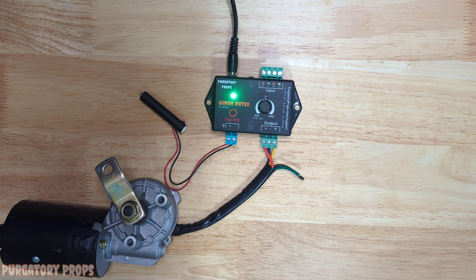Output zero has different modes. The default mode is on all the time during playback. There's start mode, which is on just for a second at the beginning. End mode is on for a second after the animation has finished — unique because you can use it to trigger other controllers when this one is done. Then there's start and end mode, which is on for a second at the beginning and a second at the end. And of course, there's strobe mode, so you can have it strobe an LED.